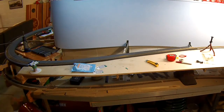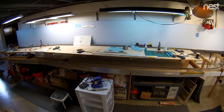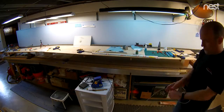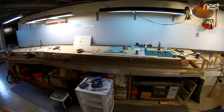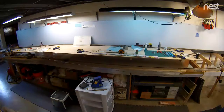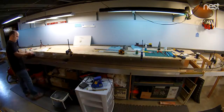Here I'm starting more or less where the red and black circuit ended, and now I'm running the yellow and black circuit. All my circuits have a black wire in common — this is 14-gauge stranded wire — and I pair that with a colored wire so I can have a logical system that's easy to track later. Once I have the black and the yellow stretched out, I go through a twisting process. This turned out to be more of a problem because the black was on that small diameter reel and the yellow wire was just loosely rolled, so one was twisted and one wasn't. I had to spend some time straightening out the black wire before I could get it twisted properly. I was shooting for about three turns per foot, so I measured the distance to know how many turns I needed to make. I'd twist a few times and stretch arms across to force the twist down towards the other end, then go back and forth to chase the twists so they're equally distributed along the length.